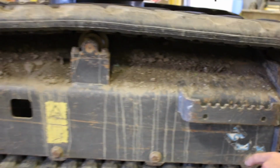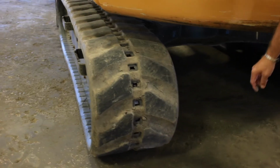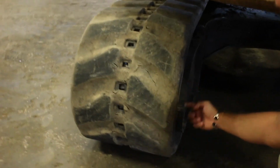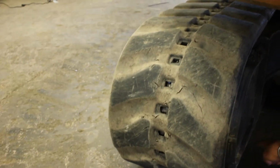A great place to check is on the back side of here. Look for leaks on a final. It's a good place to find any leaks, in this area. There's a plate here, it can be taken off. And this is where you typically will find any leaks, where the final will wear out. Not in the front, but here in the rear.